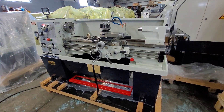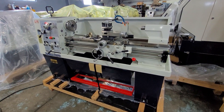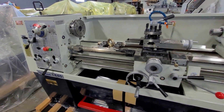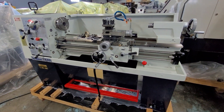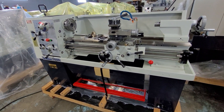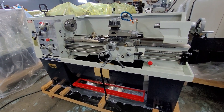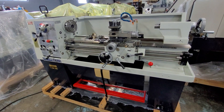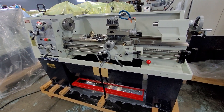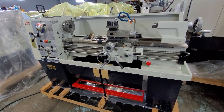This is the way the machine will show up at your facility. When taking the machine off the skid, you can use the hook right there and also have a qualified rigger help you with this placement, or qualified people in your own facility. We always recommend at least one meter of space around the entire outside of the machine. That's helpful for part loading and unloading, machine cleaning, maintenance, and it's also a safe way to set the machine up.